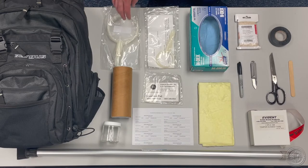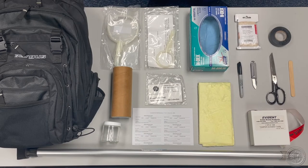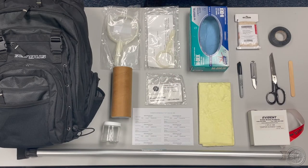The next items are sheen nets and Teflon pads. MSL recommends including 5 sheen nets and 10 Teflon pads in your sample kit. The sheen nets are expensive, so use them only when necessary to collect a viable oil sample. The Teflon pads are used to collect swipe samples and are preferred by MSL to the old school method of using a clean section of sorbent pad to collect samples from areas such as the inside of pipes and hoses. One word of caution regarding jar rings, sheen nets, and Teflon pads: make sure these items are maintained in their original packaging prior to use.